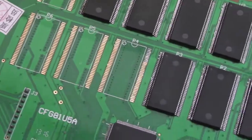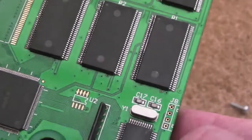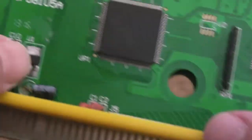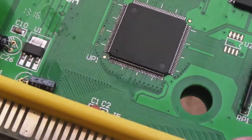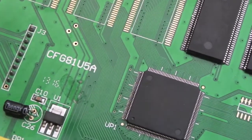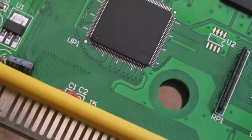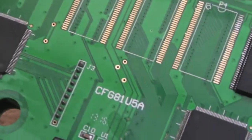Very, very similar to the 120-in-1 teardown I did. You've got a sort of CPU over here, and there's a crystal on this one — I think the last one didn't have a crystal. Voltage regulator — you can see that 3.3 volt voltage regulator because all of the logic on here runs at 3.3 volts. Pretty dirty looking board again; you've got some corrosion or flux or something just there. JTAG — I presume that's what these are — JTAG points here, there's one on each side. If you're programming these Altera Max — I think they're FPGAs — these FPGA chips, you've got two again on the top board there.